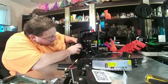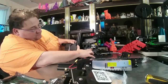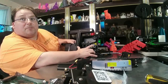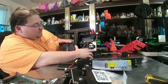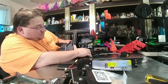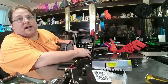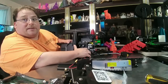One of my viewers showed me this: you'll notice the gap here between this stepper and this brace — this frame, the Y carriage — is pretty tight. So when you put the stepper dampers on, you can't. It hits the frame, and now the printer can't go back far enough to hit the end stop. The solution is to take a Dremel and cut a little nick out of the Y carriage plate there to make the gap needed. There's plenty of gap from the factory, but not enough once you add the stepper dampers. That'll be an update video coming later.